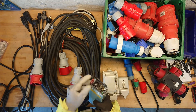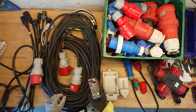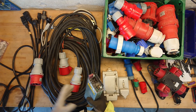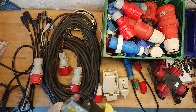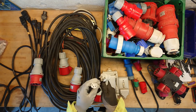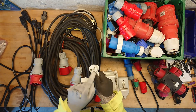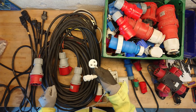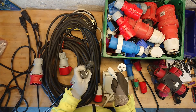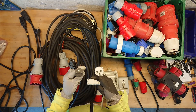The IEC connector. This is a worldwide standard for almost all equipment that you can find, especially IT equipment. But there are a few different kinds of these. We can start off with a standard Danish plug. As you can see, this comes with an earth pin, which is quite opposite of the Schuko standard that we find in many other European countries.